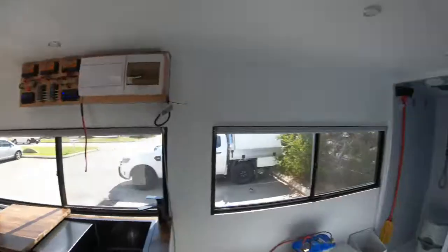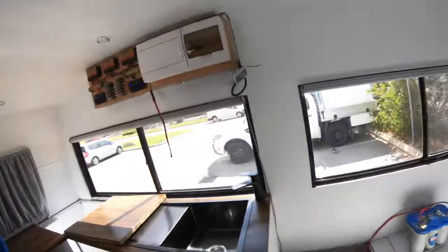Just to recap, guys: never put an appliance that is suited for outdoors in a unit like this. It's got to have a flame failure device — very important, especially when you're sleeping in here. It's super important. Stay safe and keep up these caravan renovations. It's great to see these old things back on the road. Alright guys, I'll catch you later.